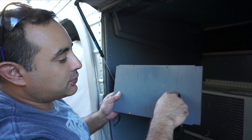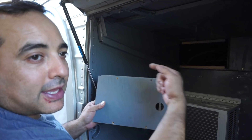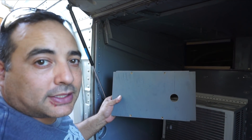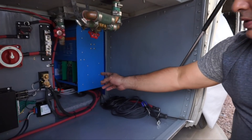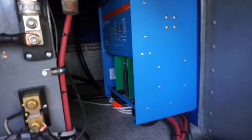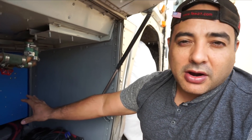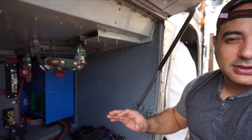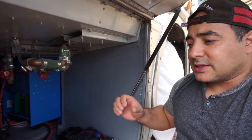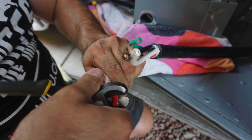So those are the things we've purchased to do the AC side. We're running our wire right now — we've drilled a hole in the little panel we made up here, so the big heavy wire will come in through there, down through the bay, and then into the inverter. We've drilled a hole and hooked it up, and we left some extra cable in there in case we have to go back and pull it out or work on it. It's really hard working cramped up inside the bay, so we left enough extra cord that it pulls out to about here so we can actually work on it if needed.